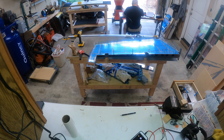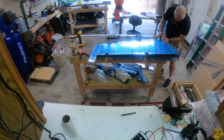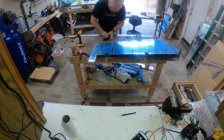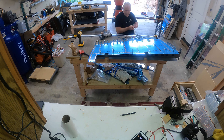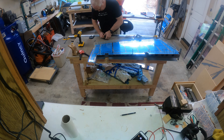I'm pondering a little bit because the instructions have you not rivet a hole that's right near the trailing edge, so I was kind of wondering about that. But I went ahead and started doing the rivets. I switched to a shorter yoke arm that has a thin nose on it so I could get it in onto the rivets that were really close to the trailing edge.